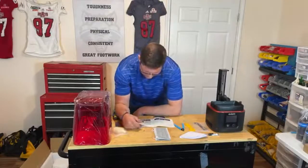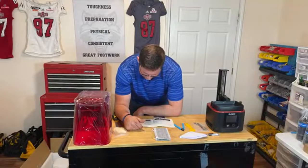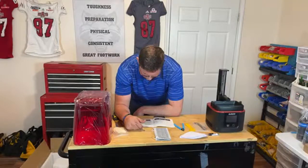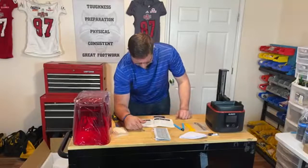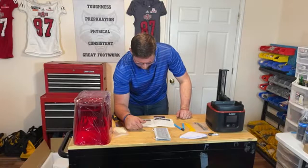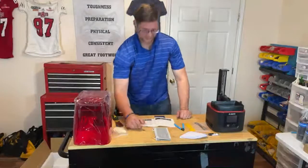Since tightening the screws of the build plate, it will be tighter when pulling out the A4 paper. At that time, you will need to calibrate the height of the Z-axis slightly. If there's no resistance or only a little resistance when pulling out the A4 paper, click to descend the Z-axis at the distance of 0.1 millimeters. If the paper cannot be pulled out or the resistance is very high, then you should click to raise the Z-axis at the distance of 0.1 millimeters. If there's some resistance, but you can still pull it out with slight effort, then the Z-axis is adjusted.